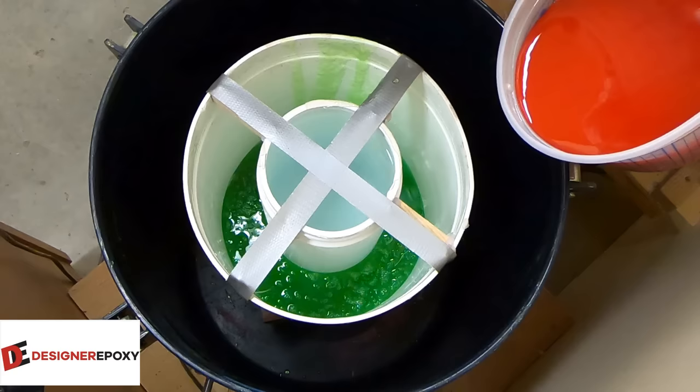So it is the next day and we are ready to remove the waste block off the bottom of this. I'm not going to lie, I was a little worried, quite a bit of overhang off of that vacuum chuck, but in the end it was a non-issue. It was on there pretty darn good. As far as finishing the bottom on this, after I got rid of the waste block, I sanded it from 80 to 500.